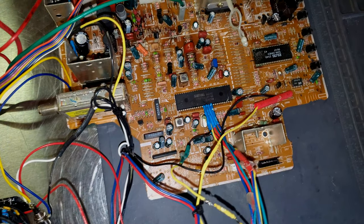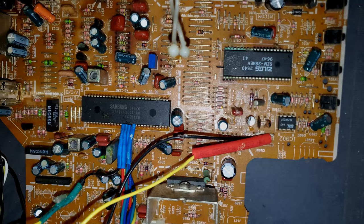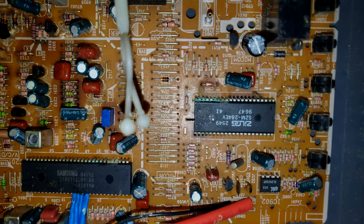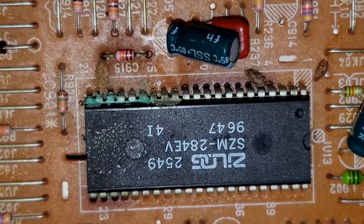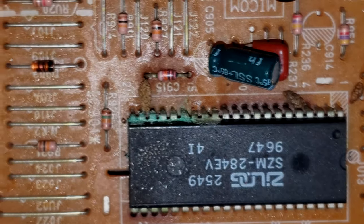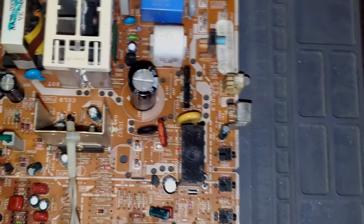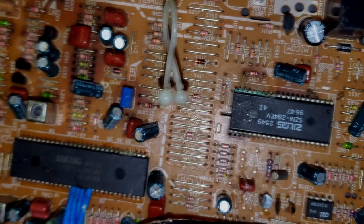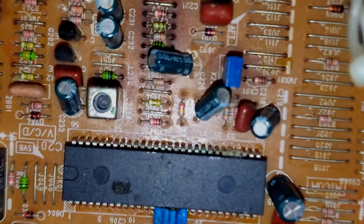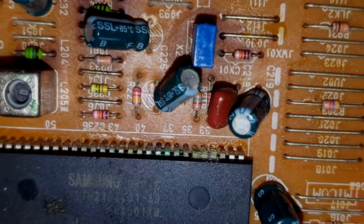Well, this is just pretty unbelievable how much damage these mice did in here. First off, check out the microcontroller - it's actually got rust building up on it, and that's all mouse urine, with some fecal matter right on our controller. The whole board is going to need to be doused in alcohol. There's that new cap kit over there in the deflection block. Do be careful if you ever run into this - this stuff can be very dangerous. They even peed over here on the RGB jungle chip.